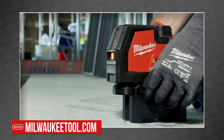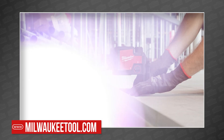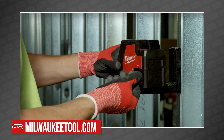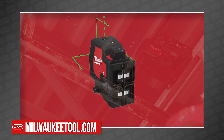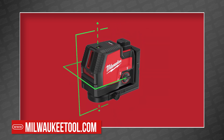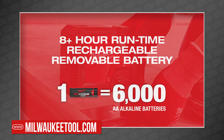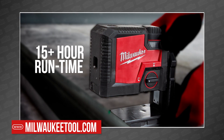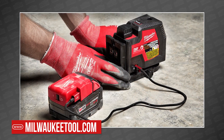These also feature micro control adjustments for precise control and faster point-to-point alignment. The three-point laser features an adjustable clearance bracket for setup over steel stud track and aligning with points on the floor, and amplified rare earth magnets keep it securely attached to metal surfaces. The cross line and plumb point laser and the cross line laser deliver over eight hours of constant run time on a single Red Lithium USB battery, while the three-point laser delivers over 15 hours on a single charge. Just like the M12 models, these are all rated for drops up to one meter and carry the IP54 rating.